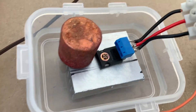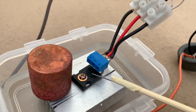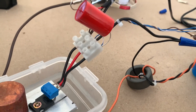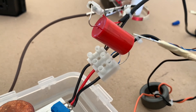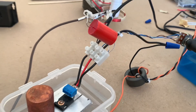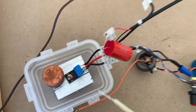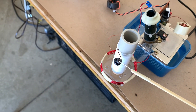To get our music we're using a simple circuit which consists of another MOSFET, identical to the one used here, and the gate of the MOSFET is modulated according to the music signal so that the amount of power that goes into this Tesla coil varies with the music signal. The way that we connect the music input is through this capacitor — this is a 3.3 microfarad audio quality capacitor. Those are very good quality capacitors and work great with this. Your music goes right through here to the gate, which then switches this on and off, which then changes the amount of power going into this coil.